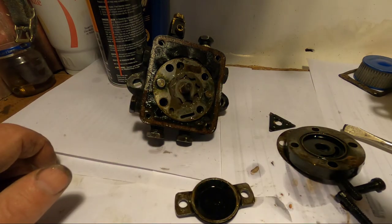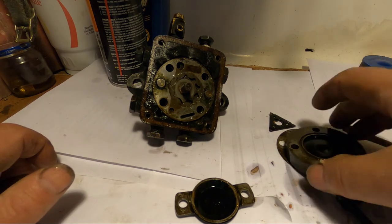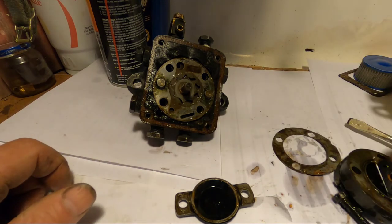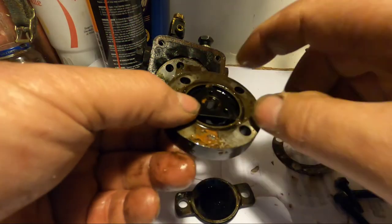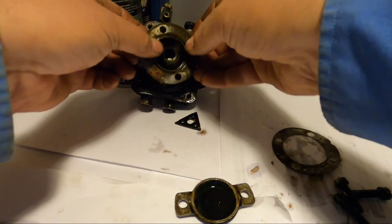If you have your tech come over and he gives you a choice on which pump to go for, the Suntec is a lot quieter. And I believe, again, the reason for all the noise is this spinning around all the time. And you get to see there isn't any filter in here, but this grinds it up. Okay, I'll put this together off camera.